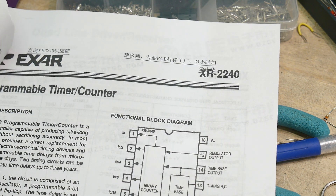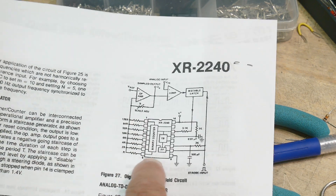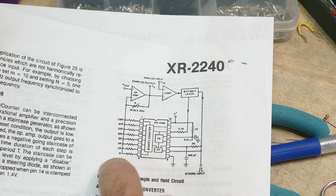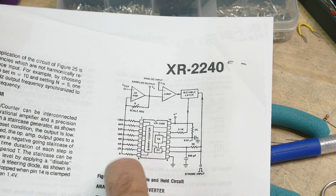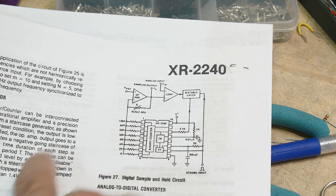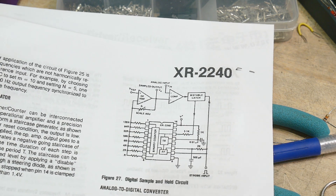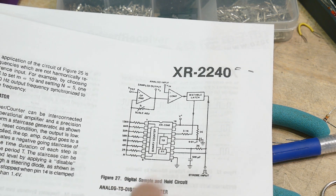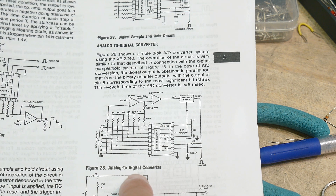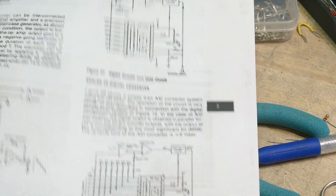One of my favorites from the datasheet is something like this: these are all open-collector outputs, which should be noted. This design has an R2R ladder of resistors going into an op-amp, so as it's counting, it's actually stair-stepping a voltage output — that's a neat idea. Another application takes that similar idea and turns it into an analog-to-digital converter: you have a comparator, let it cycle up, and it stops when it sees the right level.